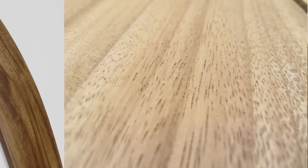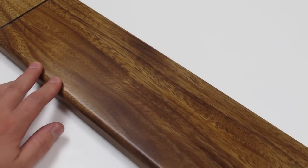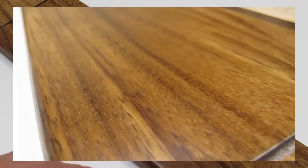Because the wood is so coarse-grained, a good way to get a glass smooth finish is to apply a wood grain filler. The filler used here is tinted with a walnut stain, sanded smooth, and then finished with a few coats of just spray lacquer. The tinted filler darkens the pores and adds just a kiss of color to the surface. And it looks really nice.